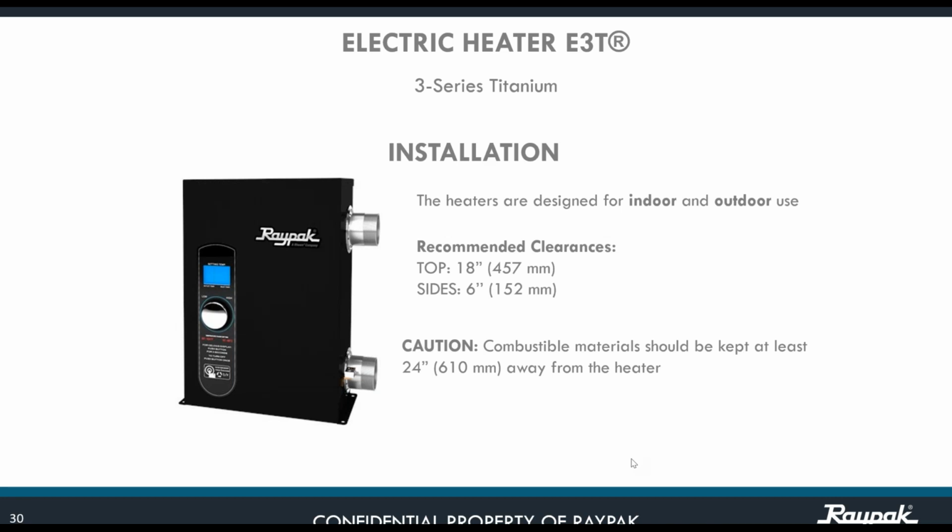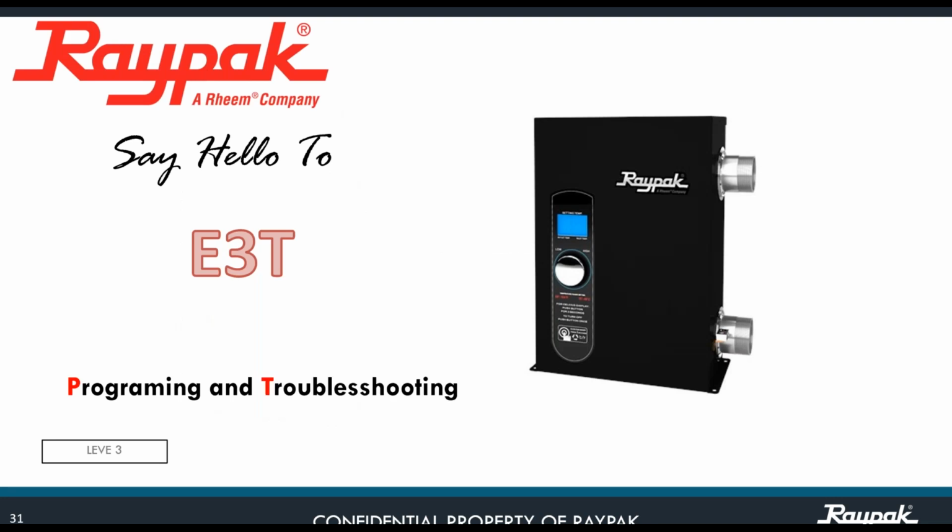And besides, do not make the connection in a reverse way, connecting the outlet connection where the inlet is supposed to go, because it's not going to work. Remember that there is a flow sensor that needs to sense those 15 gallons per minute in order to operate properly. You might think, no, that is not going to happen. It happens, sometimes. Okay, now let's start with the... looks to me like there is a question over here.